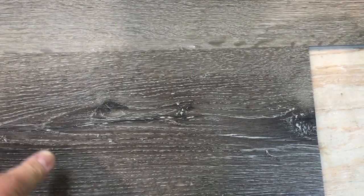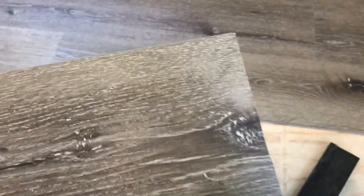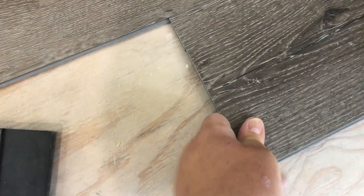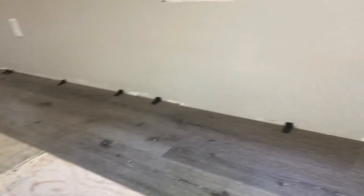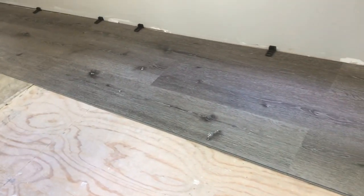When you have to cut your pieces, remember to cut and keep a lip on the end for the next piece. I've made the mistake two or three times — I cut straight ends, so when I started staggering and came over, there was no lip end. Make sure you leave the lip end in when cutting the little pieces. This particular one has the underlayment and it's a little bit wider than the one I did before. They make it look easy on these videos, but just take your time — once you get to two, three, four rows, you pretty much got it.